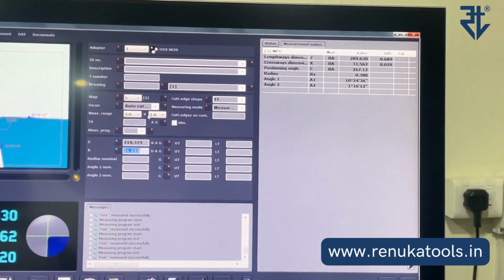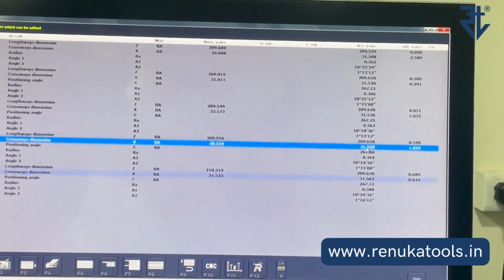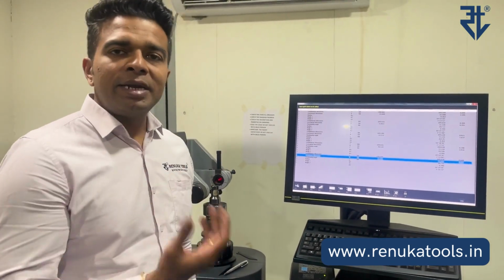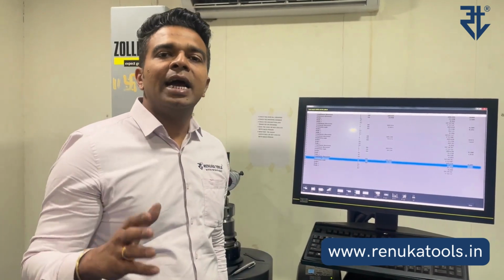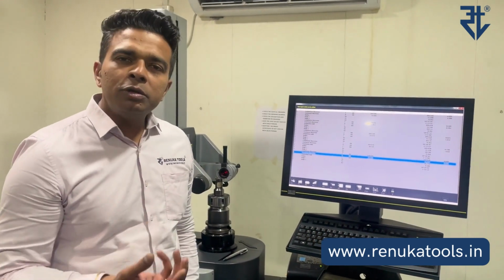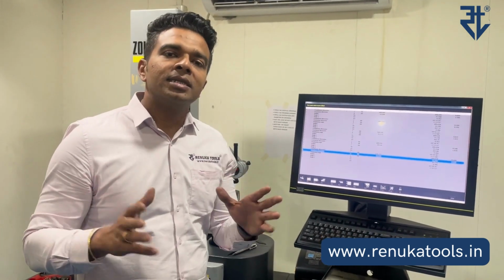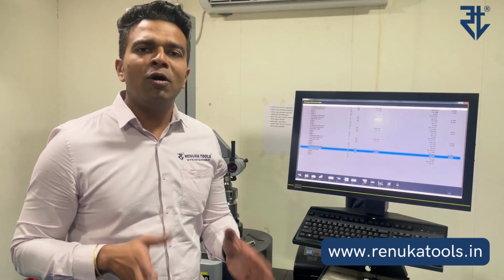Five, 6, 2. So it was 558 and we have got 562. So that means there is exactly a 4 micron movement, as I said. So it all depends on what kind of control you have over your hands, and the results are going to be exactly as promised. Please understand, this is a mechanical unit, it is not a digital unit. So yes, there are bound to be some errors in terms of your movement, in terms of your matching, what you decide that yes, now these lines are matching. So there will be some errors here and there, but this unit is a fantastic, most precise boring unit that Renuka Tools manufacture in Aurangabad, Maharashtra, India.